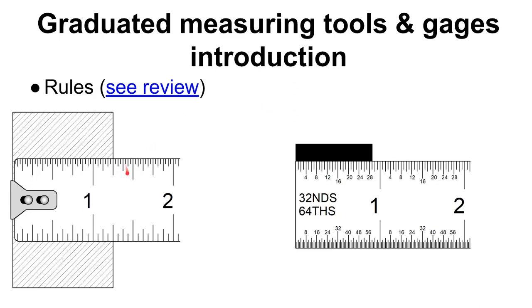The quiz will also cover reading a ruler. If you're not familiar with reading inch rulers, do some independent study. Count the divisions: if there are 16 divisions per inch, each mark is one-sixteenth. Four sixteenths reduce to one-quarter. So a reading of four marks past the one-inch mark would be 1.25 inches. More marks just mean higher resolution — the same principle applies.